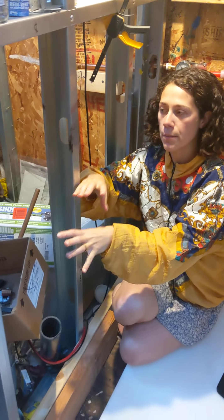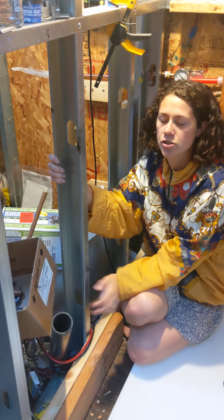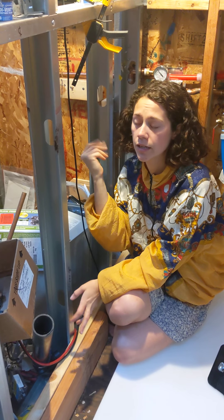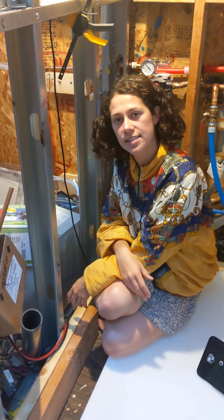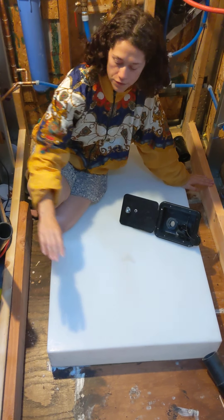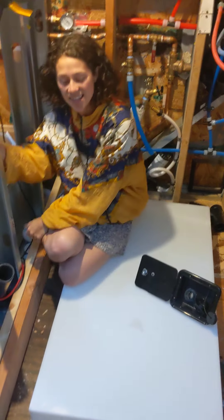The copper line continues through this wall here — I've got my bathroom sink and kitchen sink right here. I wanted all my drinking water to not go through plastic, so I tried extra hard to keep the water fully in copper before it branches off to PEX — just my personal preference. That's the system so far. We're building up a subfloor here, and all the drainage will go within the subfloor so you'll walk up into the bathroom.